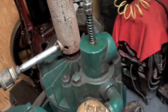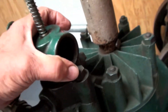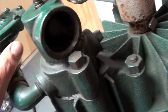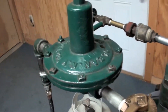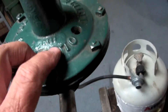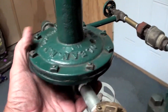The other things I've noticed since I got it running: this spring needs a little adjustment — it leaks gas just a little bit, and if you're not careful and not watching it'll catch fire right here because it's leaking a little bit of fuel, especially if you leave the valve on while it warms up on the tube. So this intake valve needs lapped, and the rod needs to be shimmed up — it's gotten a little noisy on the rod on the crank throw. This regulator is actually upside down; there's an atmospheric hole here, and out in the weather you certainly don't want that atmospheric hole facing up where it can get water down in there. So that regulator will eventually be turned right side up.